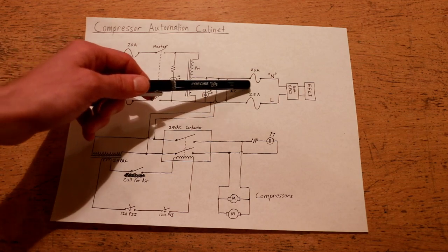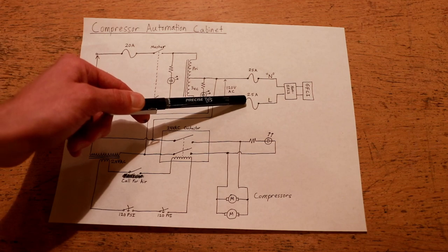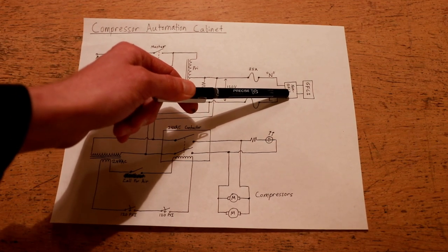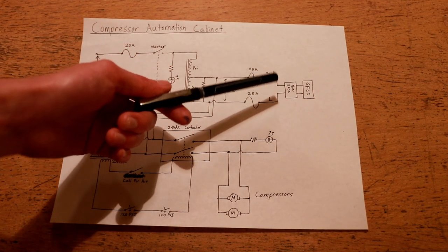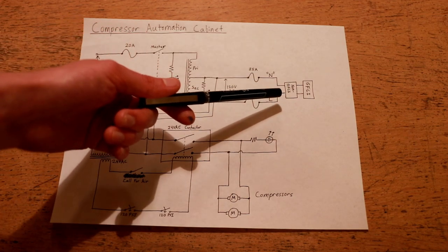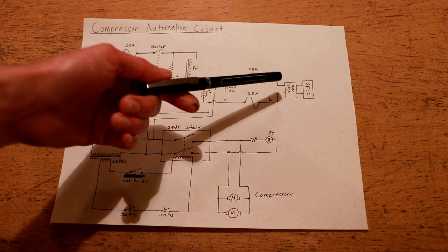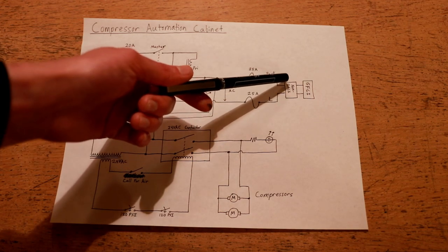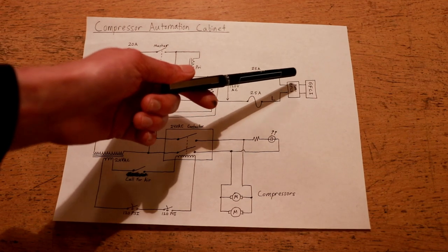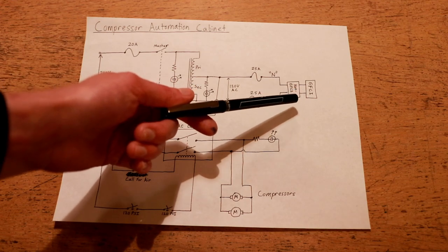I've defined the secondary tap as the line for the 120 volt system because the primary side is fused. If the winding connected to the output were to fail open, it would place 240 volts across 120 volt loads, which could be destructive. The secondary is less likely to fail open since it has no fuse. If the fuse on the primary opens it simply shuts off the entire transformer non-destructively. The output routes in two directions: one through 25 amp slow-blow fuses to the hotel power circuit — a non-GFCI and a GFCI protected receptacle for this outdoor location.